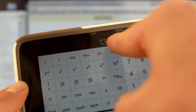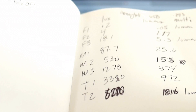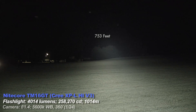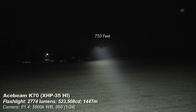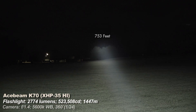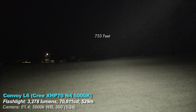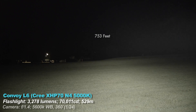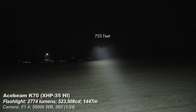Rated meters isn't quite real-world meters. Lumens and candela measurements are a good way to compare flashlights within the FL1 standard, but don't expect the light to be visible on objects as far away as the ratings say - if it says 1000 meters, you're not going to see something 1000 meters away. I'd recommend looking up exactly how FL1 standards measure candela for more detail. My figures are good estimations and comparisons between the lights I have, but don't take them as the most accurate. I'm just trying to double-check the manufacturers for you. My tested figures and not manufacturer specs always appear in my beam shot review sections, and they back up what you see in those shots.